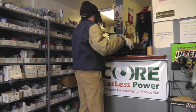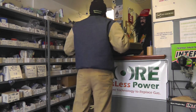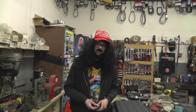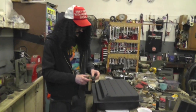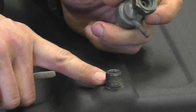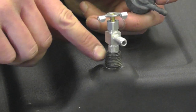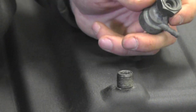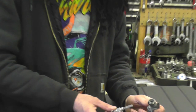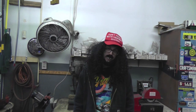I wanted to thank you for helping my son with the tire chains on the snowblower. Oh yeah, that guy. Alright, I'll come back later. Now, what we're going to do today is, in order to fix this, on this tank, this fitting here screws on the outside of these threads here. So what we're going to do is take one of these smaller hole ones and tap this out and stick it inside there — it's going to be inside instead of covering the outside. It's one of those thinking-outside-the-trailer type maneuvers. Terrell Sr. had to take a sick day — he had some bad Rocky Mountain oysters and boy is he tore up.